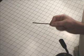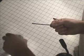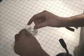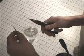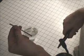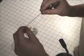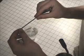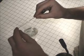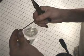Next, we're going to use a torch to heat this little band that we ripped off to make our tension tool. So we want our water to actually temper. Now what we're going to do is heat it up and bend it, always using pliers to hold, and always be careful using fire. We want to bend approximately 1/4, maybe a little larger, maybe a little smaller, of the top over when it's red hot. When metal gets hot, like carbon steel, the crystalline structure inside changes, and you will actually make it very soft. So by making it extremely hot and then dunking it, you keep that crystalline structure, or change it to your favor to make it more rigid.